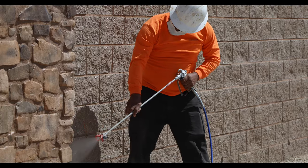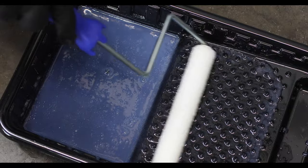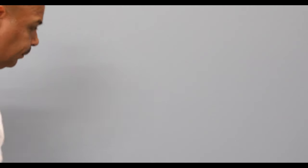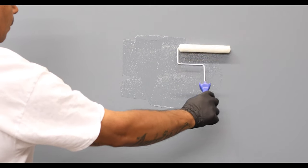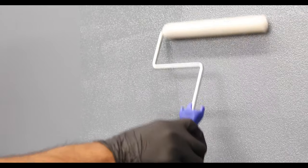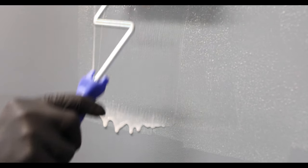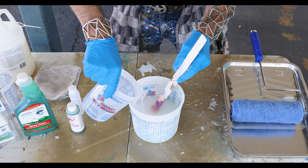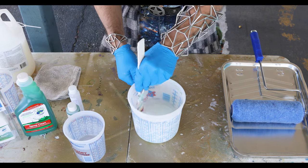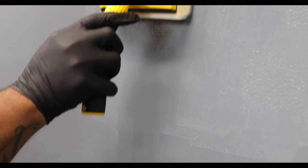For smaller areas such as 100 square feet or smaller, a paintbrush and roller could be used. The main thing is to not over-apply — if applied too heavily, the coating can turn milky or cloudy. The key is to apply thin coats. If the product seems a little too thick, or if you notice it's foaming as you're rolling it on, you can add water to thin it. Reapplication time is dry to the touch, or one hour.